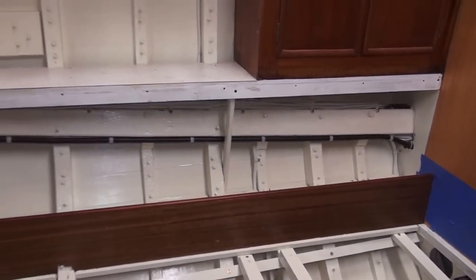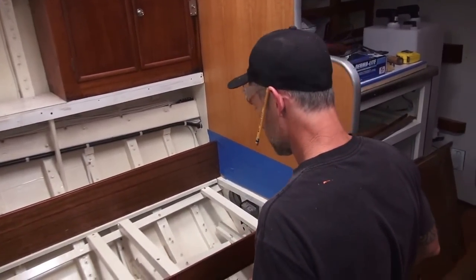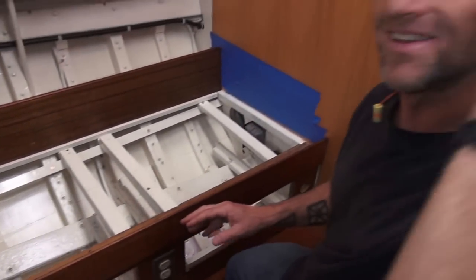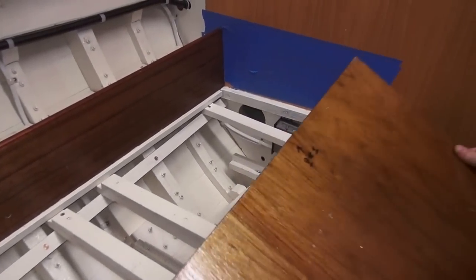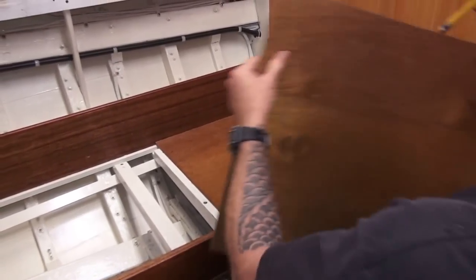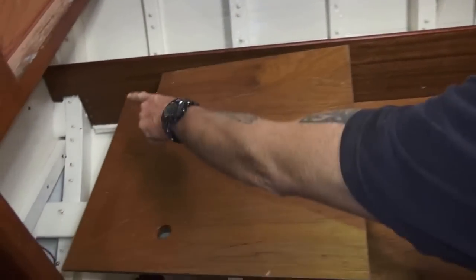This piece doesn't raise up — when it gets installed you don't get behind there. But the one on this side has the piece that flips up, so it gives you access. We brought this down just so we could check things as we're going. These pieces right here weren't flowing — one was down low, one was up high. So what I did is basically got a straight edge on here so they all flow in. That's so important, because after we stop sailing this is where we live. We've got all kinds of people, shapes and sizes — it's got to be solid. I numbered them all too. This one had to be cut down later — it had a notch in it, with about eight more inches on here, so I put a new cleat back there.